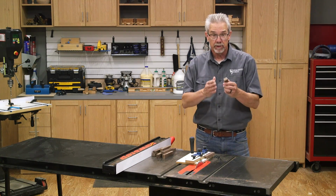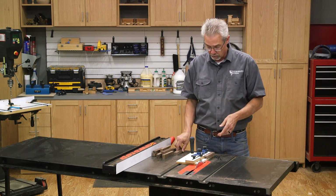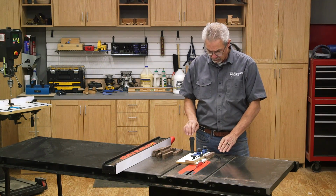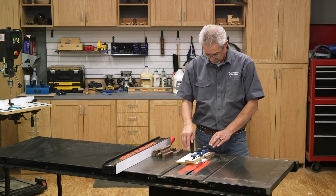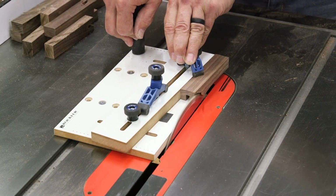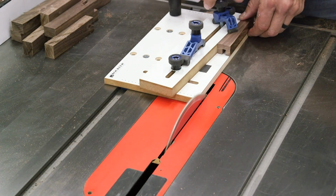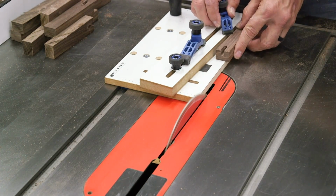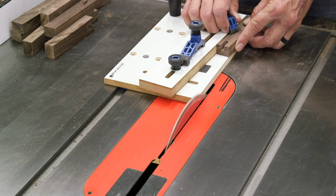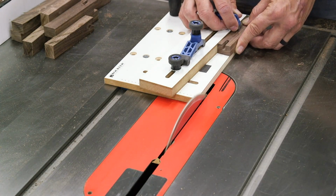You can cut the tapers on these rays any way you like, with a bandsaw or a jigsaw or a scroll saw, but I'm going to use a table saw and employ this little jig. It works fast and is very accurate. Set up the jig to cut the first angle. The groove in the blank should be facing forward and down on the jig. This is another place where a test blank can come in handy. With that done, cut the first angle.